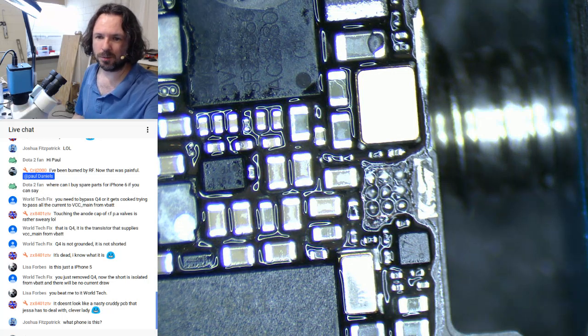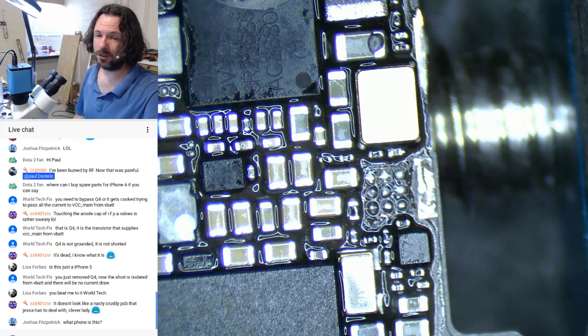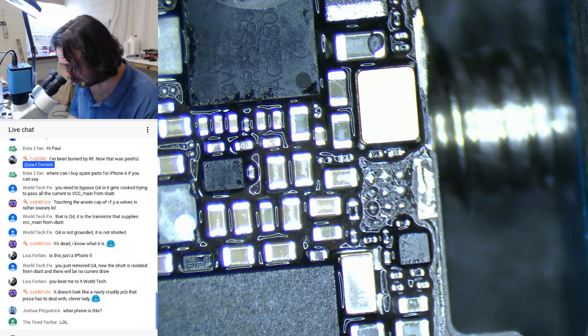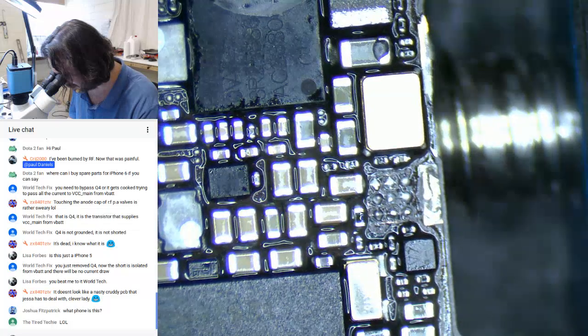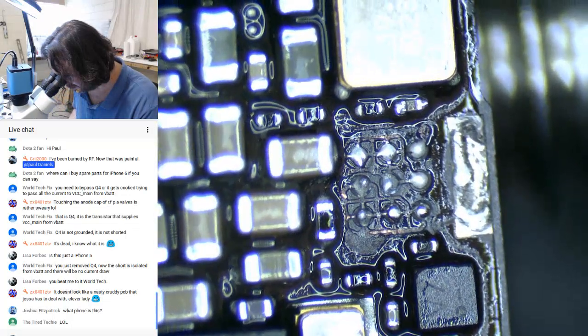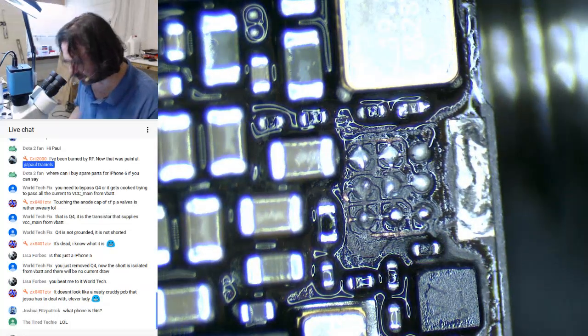Okay, I'm sitting down at 200 milliamps. Theoretically, it shouldn't do anything, but... Oh, interesting. It's still drawing a full short. If I... Any of those pins there? And... Looks like a tiny amount of corrosion in that middle pin there.